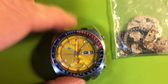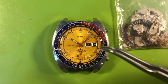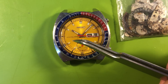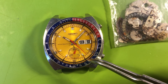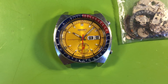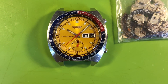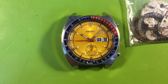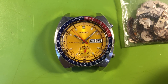Okay, I just want to set some time because this is what it looks like now. I am frankly amazed at the job I was able to do to clean this dial. The water had pooled and sat underneath this hand and there was a stripe of rust across the dial and rusty residue everywhere. You can see the staining here. The outside of the indicator ring was literally packed with rust from all the corrosion that had gone through the movement. I had to clean everything very carefully using magnification, sharpened pegwood, and chemicals used to bind with oxidation to remove this stuff — very, very gently. And you can see the result. It came out way better than I ever thought it was going to. The movement is beautiful — bright and shiny. I should have shown it to you; I might do that in a second.